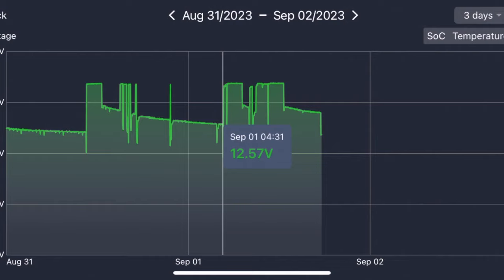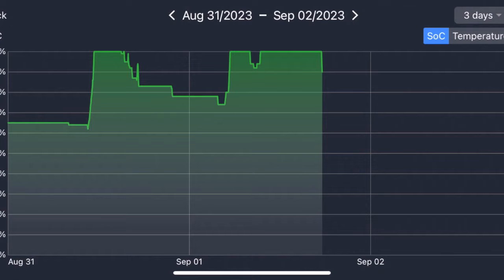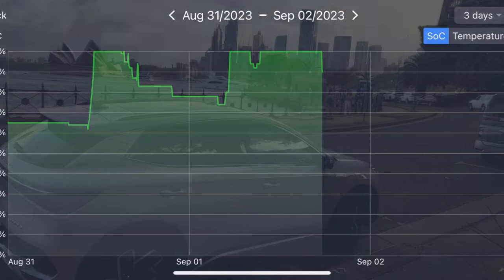So that's the Bluetooth battery monitoring, and I think it's a very good tool — I'm glad I installed it. The state of charge view shows that 50% of the time the battery is at full capacity; mine doesn't drop below 60%, which I'm happy about. I hope this was an informative video. Please subscribe to the channel if you haven't already, and I'll see you in the next video.